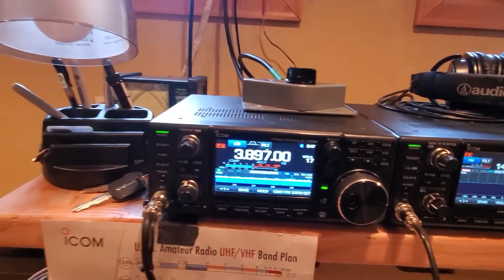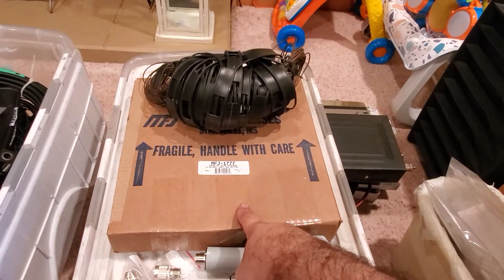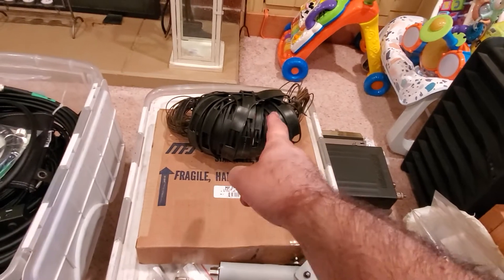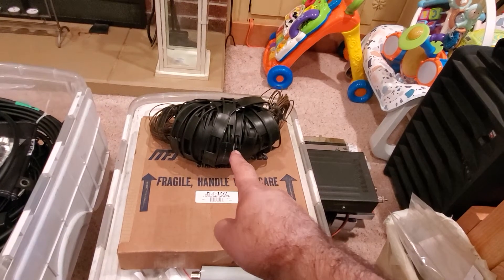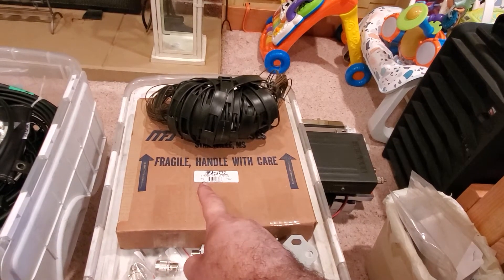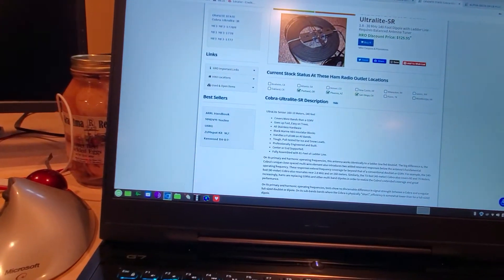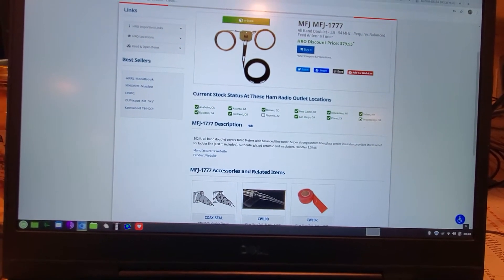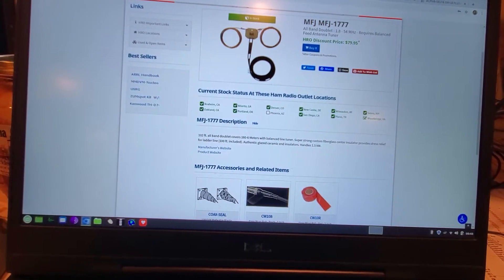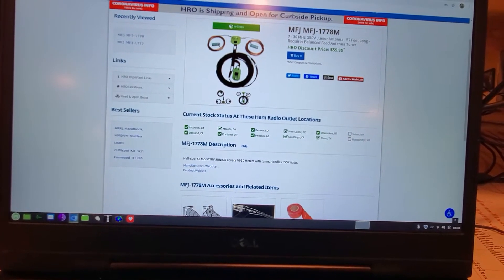I've got a lot of things to do today. I'm going to be swapping out antennas and going to this doublet — it's a standard G5RV, 102 feet of copper and about 33 feet of ladder line. This one is similar: 102 feet of copper but with 100 feet of ladder line, which makes the difference. The standard G5RV is 102 feet with about 30-some odd feet of ladder line.